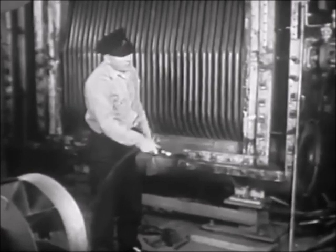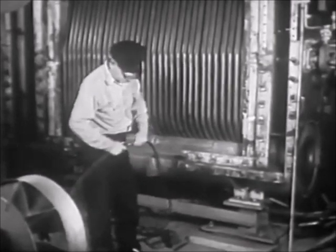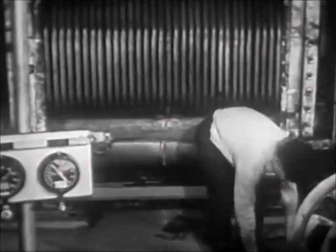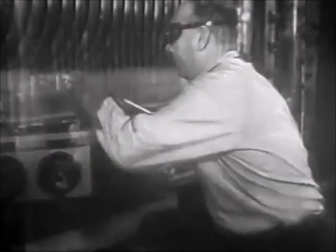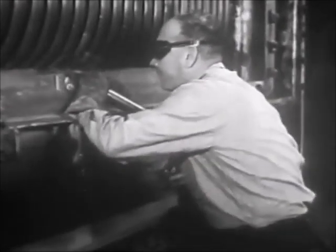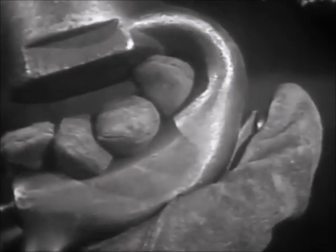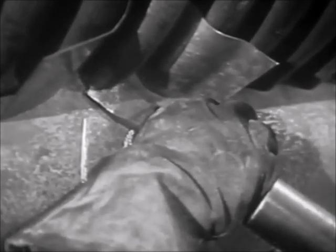See that the line is cleared of moisture and the air hose is properly connected to the air supply. Now place the tool so that the flat of the chisel rests on the water drum. When starting the cut, be sure the gun is held firmly against the cutting tool. Press the trigger until the tool begins the cut and apply pressure gradually. Continue the cut until the tube is completely severed.